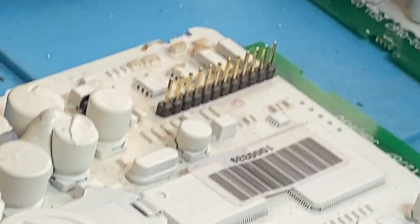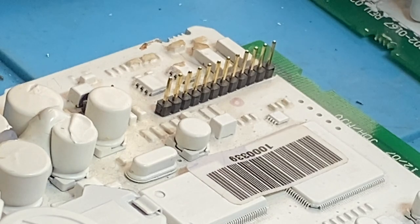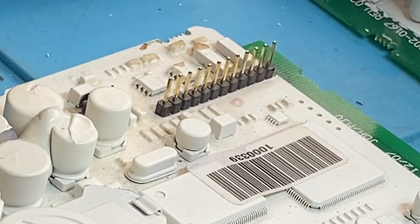So we're going to nut it out as we go. You could have done something like put in a switchable gain section, so you run fine gold at reduced gain, and when you flick into the other modes, it puts the gain back up to where the other GPXs were. But I do know it's easy to tell, because the feedback resistors that control the gain of the op amps are different values in a 5,000 and a 4,500. So gain's going to be different.